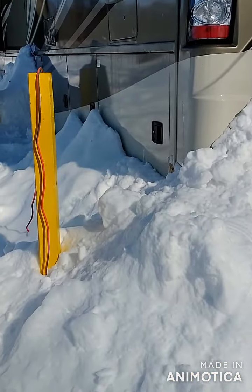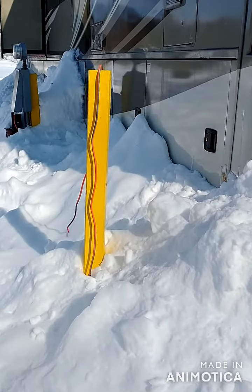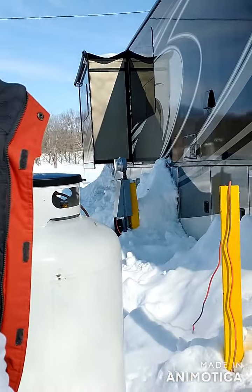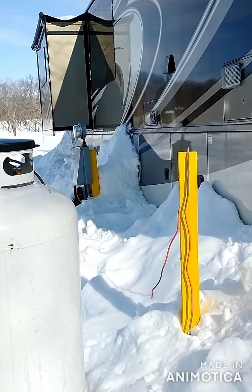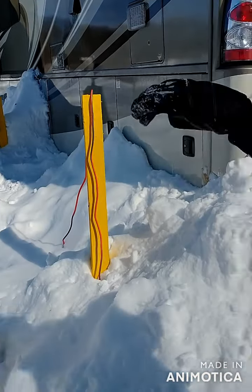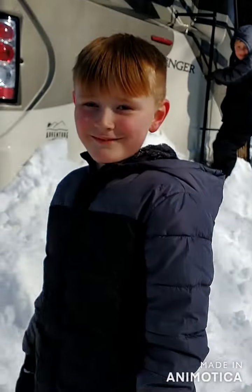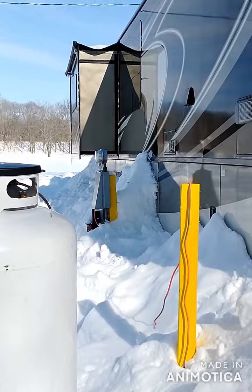The snow has added quite a bit of insulation. We left the water on, wrapped it in a heat cord — and you can get styrofoam to wrap the water hose — and it flows fine. I haven't had a problem with our water line freezing. We had left for a week and came back and the park's RV spigot had frozen. I just wrapped some more heat cord on that and within 30 minutes to an hour it had unfrozen.